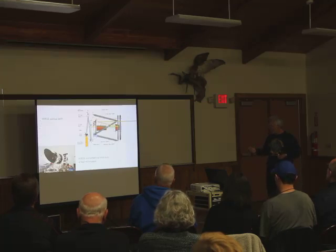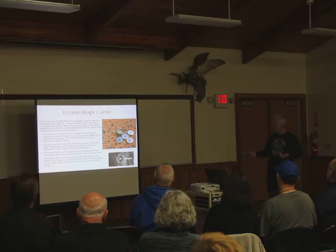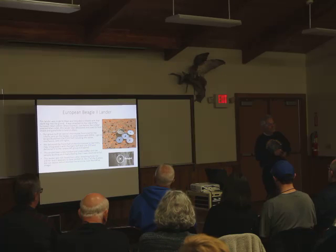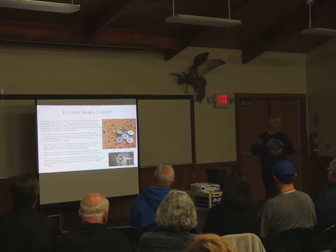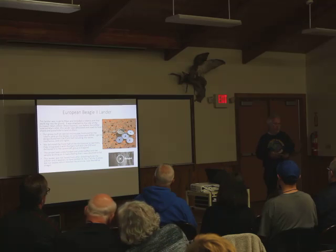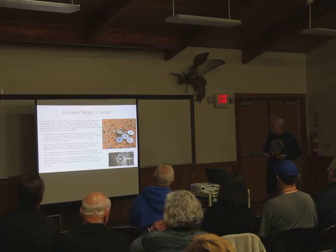It appears, this picture is taken by the HiRISE Mars orbiter. 2 of the 4 petals, here's the base part, and the petals are supposed to deploy out, and 2 of them did, but the other 2 didn't. And that means 2 of these petals were still wrapped up on there, and they covered up the antenna. So that's probably why we haven't heard from it, because we can't communicate. And without power from 2 of those petals, the battery didn't last very long, and it probably died.